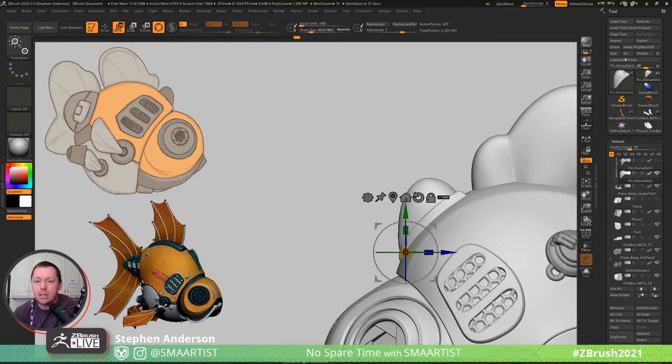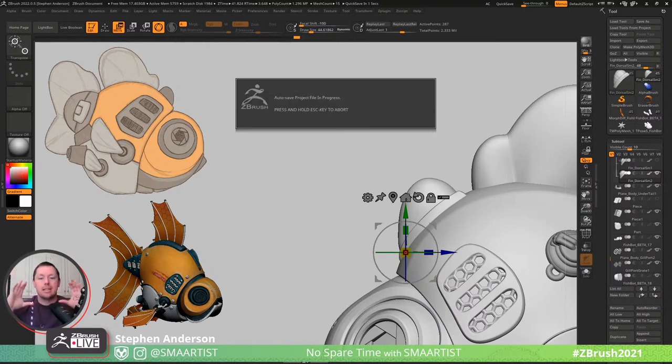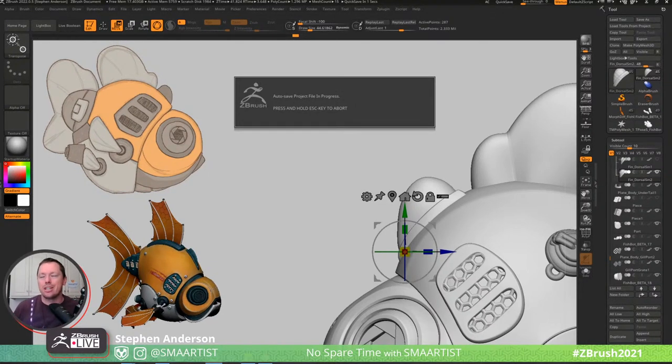I'll have to see. I think there are two ideas that I have for making those masks. Either you could vacuum form plastic over the top of your piece and then cut out the parts where you want the paint to go through. Or you could, like you're suggesting, use booleans: create the piece and then extrude out from wherever you want to mask off, then just delete the holes, and then give it thickness, and then you're good to go.